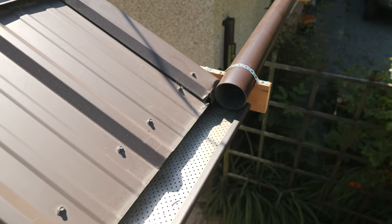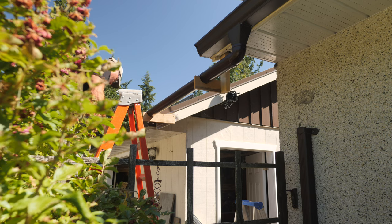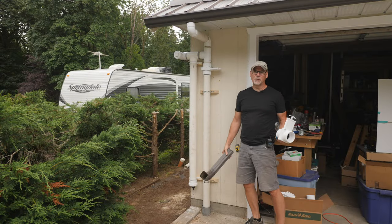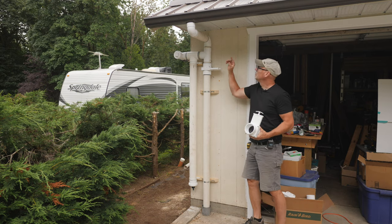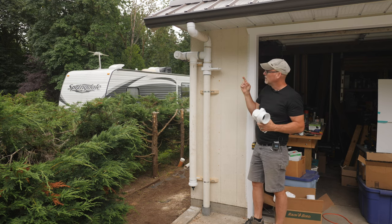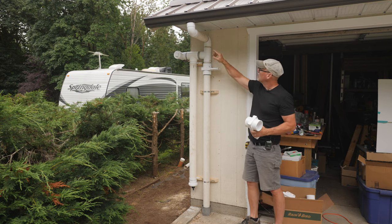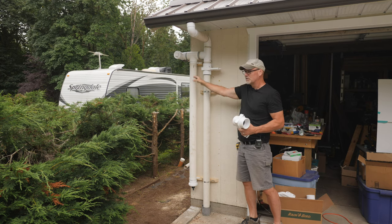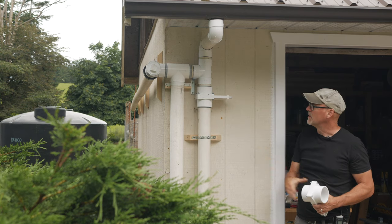In the winter when we get heavy rains I can remove the pipes that connect the gutters and reinstall the aluminum downspouts. So with the tank in place I replaced the aluminum downspout with three inch PVC pipe and included a sliding gate valve. In the summer when I want to collect water I have the gate valve closed. Water backs up against the gate into the first flush diverter and then around the corner to connect to the downspout on the other side.